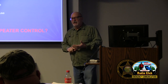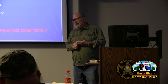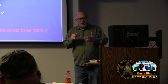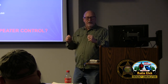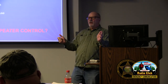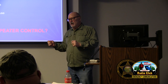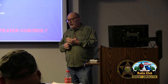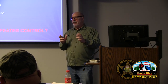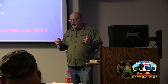So the HamVOIP is actively in development. All-Star is kind of stuck right now, although they're starting to get back together. You can do several different things with, I'm going to just call it All-Star because that's how it originally started, but you can do several different things with All-Star. I'm talking about linking right now. You can use it also as a repeater controller, so you wouldn't need an ARCOM or anything like that. You can use the Raspberry Pi with the software for a standalone repeater. You can use it on multiple repeaters.